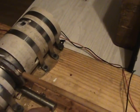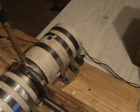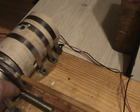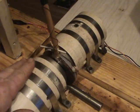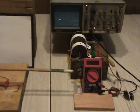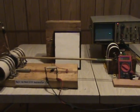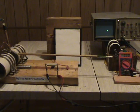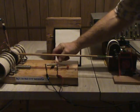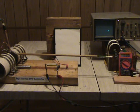This here is my spacer in between. If you decide to do anything, again, it's your responsibility — these are very tricky to get in there. This is holding this apart, strapped down. We'll go ahead and go into the measurements. I decided the best way would be to take measurements of my motor — what it pulled by itself without any load. So I've disconnected the coil from the generator and we'll go ahead and test.